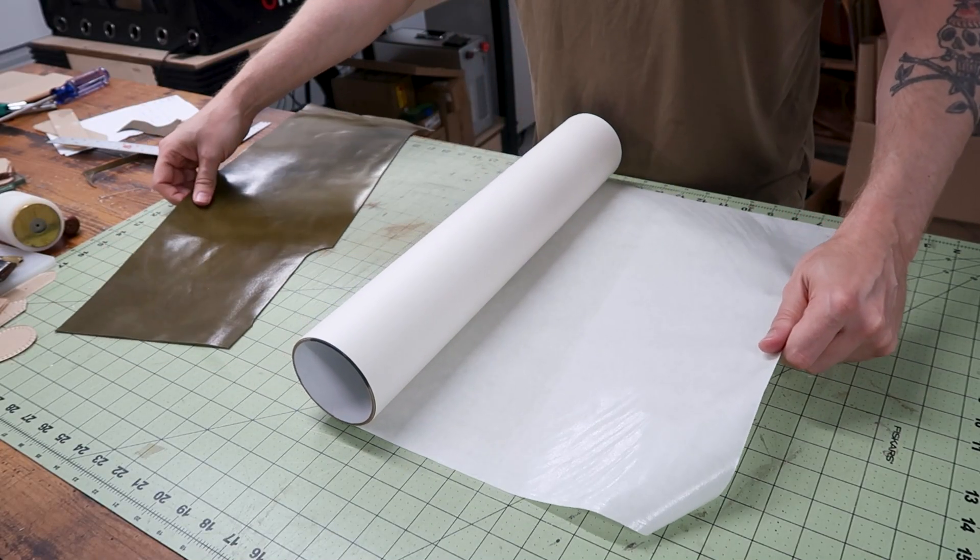For the second project, I'm going to use the D1 Pro to laser engrave and laser cut a notebook out of some top quality vegetable tan leather. For me, this will be the true test of the D1 Pro since leather is the material I'm most comfortable with. Normally when cutting leather, I'm using my CO2 laser and I prefer to mask the surface with airbrush tape — this helps reduce the surface scorching, which can be annoying to clean off later. However, the D1 Pro is a blue light laser, and blue light lasers don't work especially well with colors like white or clear. I'm not in the wasting leather business, so I opted to run the file without masking.